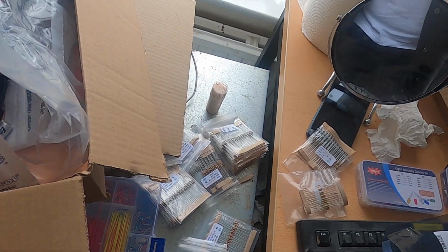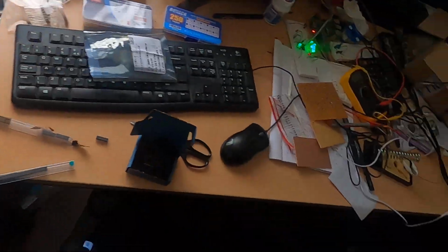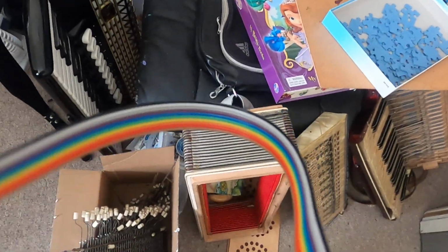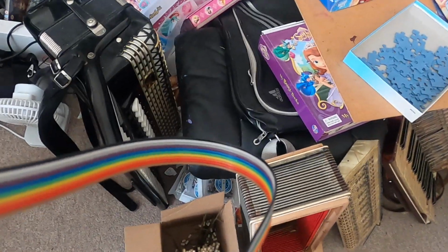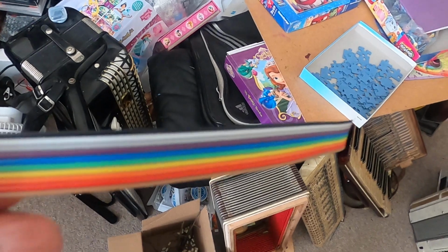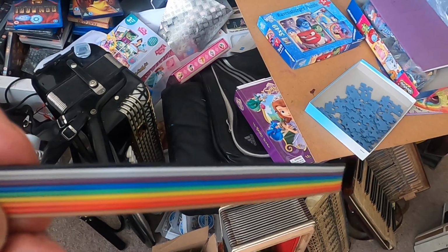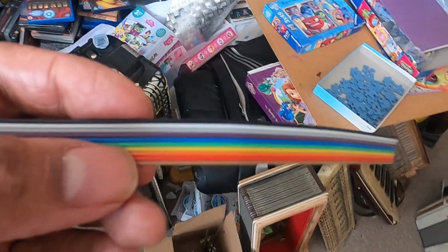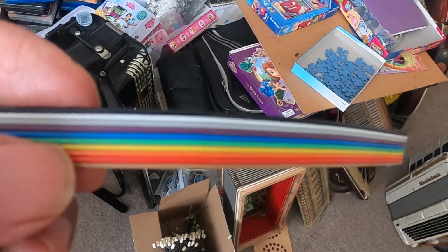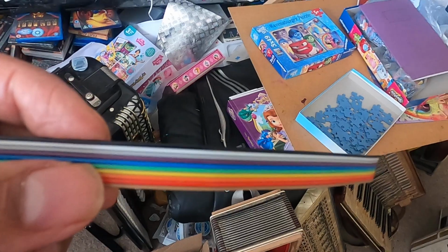I can't remember how to solder. Got loads of wires and bits. This is the ribbon cable. It's going to go through the bellows, and carry data to and from the bass side of the accordion. And it's a 10-way ribbon, so we're going to need power, ground, 3 address select, 3 data select, enable and one data bit, and it's going to scan each switch one at a time. It's really quick. It'll do each one in a few nanoseconds.